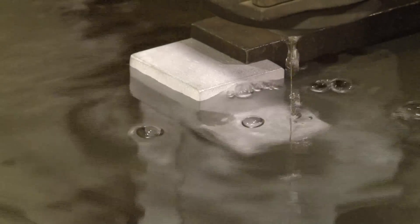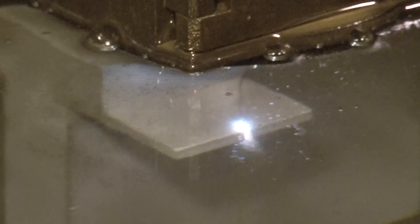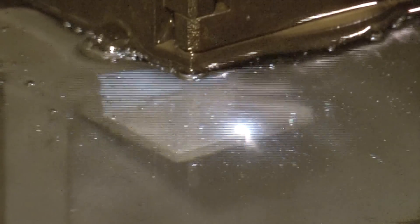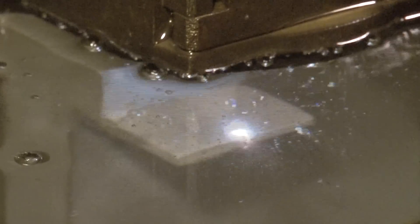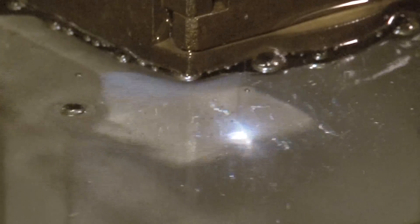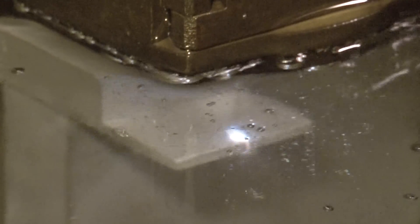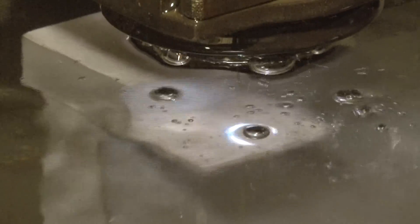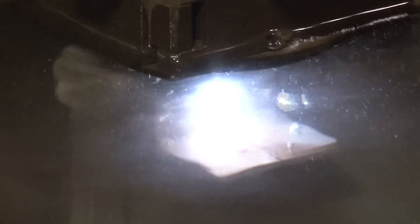The water acts like a resistor. Now we see the spark erosion taking place and it's cutting. Sparks jump from the wire to the workpiece, and there's always a gap. Later on we'll go into much more detail about what actually happens within that cavity. It is spark erosion — the sparks are eroding the metal particles, and then the filter system removes the eroded particles. Now I'm going to turn the flush on — this is what we would normally have, but then you can't see the sparking as well. Look at the sparks now — it's cutting into that edge. There you can see the full length of that wire cutting into that edge.